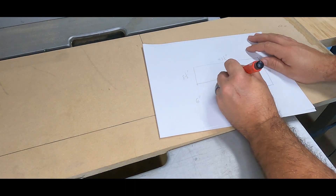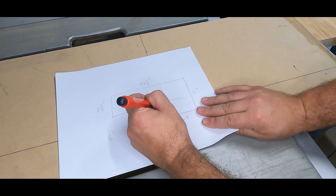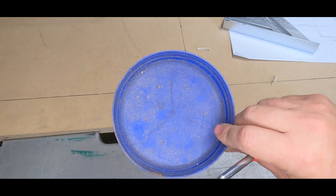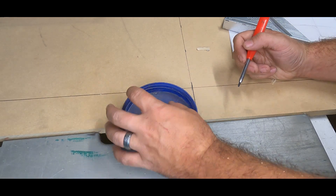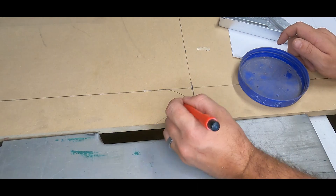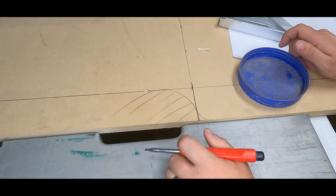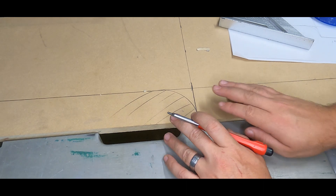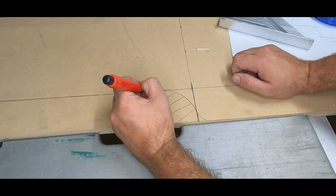Right now if we go like this, we've got this point right here. You're probably wondering how we're going to get that perfect circle — I tend to use old lids and stuff like this, and it's pretty easy. We've got our two measurements here and all I'm going to do is just press this in. I'm going to cut a bunch of relief lines here so I don't put too much tension on my blades, then I'm going to jigsaw it. This method gives me a really good starting point. Next I'm going to take it to the table saw and only cut to here.